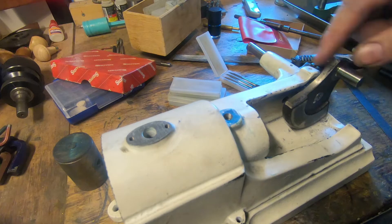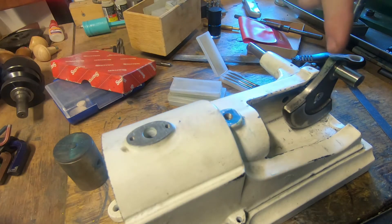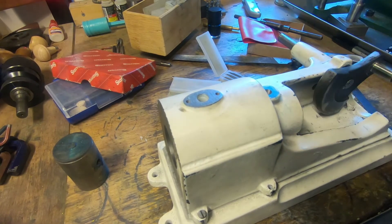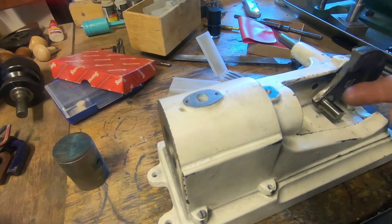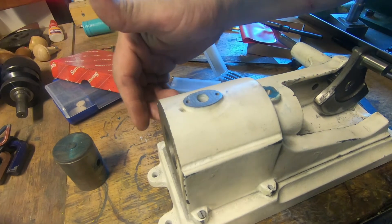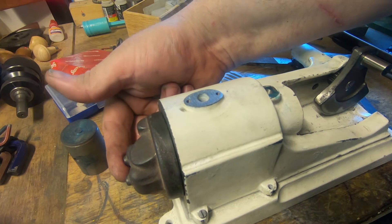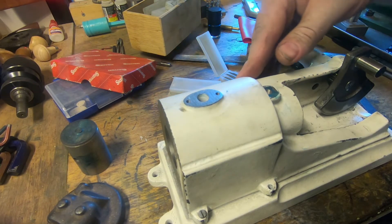I just recorded all that without the camera going, but anyway I've got a thread in here — I've drilled it number one and tapped a quarter by 40. Now these model-maker's taps when they come are generally pretty useless. Nearly all the ones I've ever seen have got this crazy point on them that's ground like that — a pain because most things you would tap with these, being tight pipe fittings for gland nuts and fittings, are mostly in blind holes. You don't even touch the thread before this touches the end of the hole. I generally take the intermediate down on the bench grinder, and I take the plug down a fair bit more, because that gives you at least a few threads.